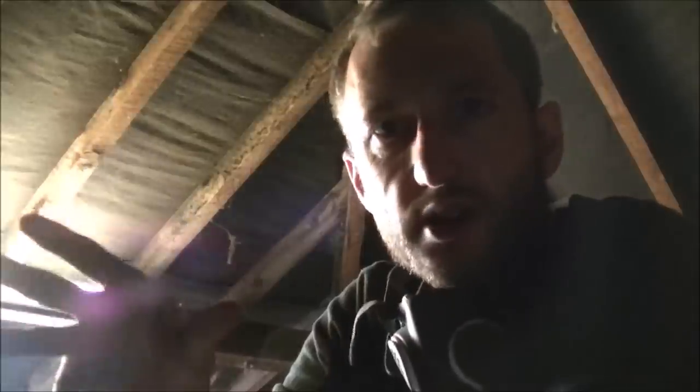Another thing you can see with an old house is that the purlin isn't bang on straight — the joists are slightly wonky and the floor height over there isn't bang on — so there's going to be a lot of work to get this right. By doing the loft conversion myself I'm going to utilise every single bit of space possible, whether it be a sliding door cupboard or a little cupboard for the hoover in the corner. I'm also still considering whether to fit in a toilet and a sink, but I'm going to measure that up when I get the dormer in and see if it's worthwhile or whether I'm better off giving the space to the bedroom.